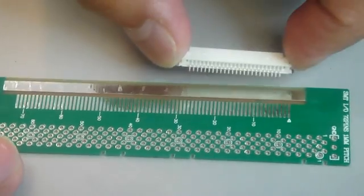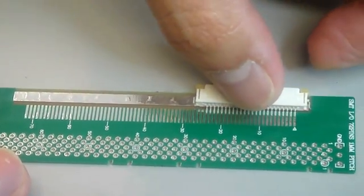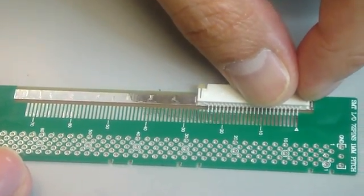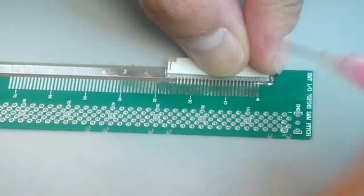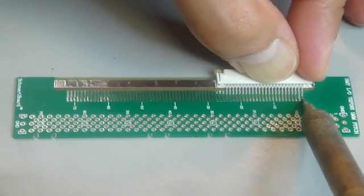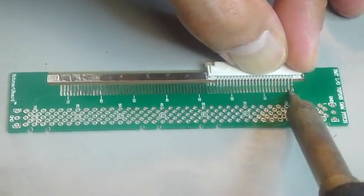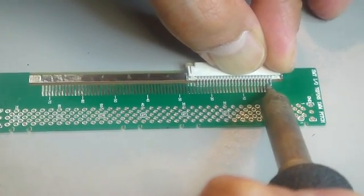The SmartBoard SMT connector board allows you to place the component easily, and solder is already on the board, making it very easy for you to hand solder the component. A little bit of solder flux, and then you basically put the tip of the soldering iron in each of the grooves, and push forward until you touch each of the legs on the SMT connector.